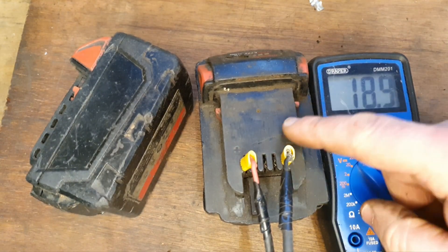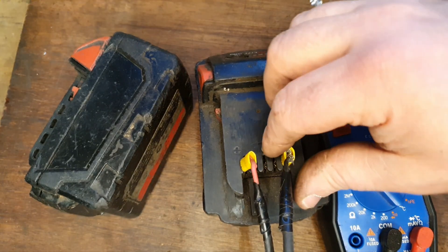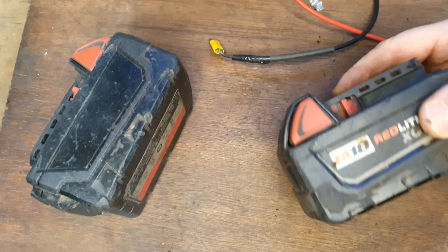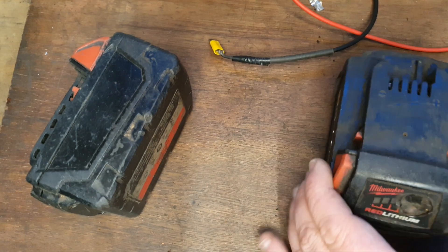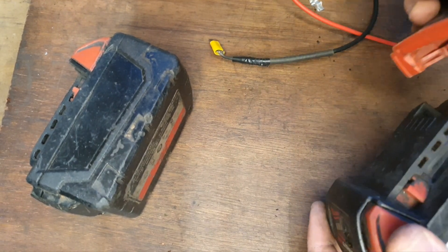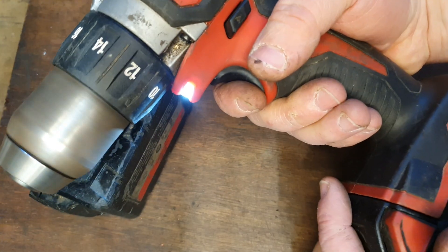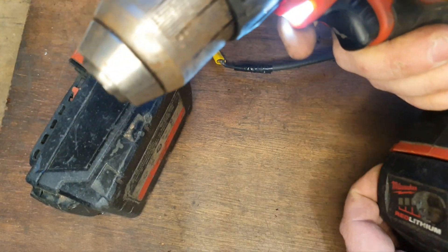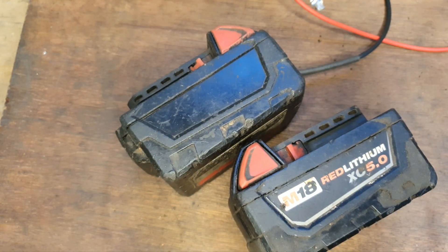Battery number one had been on charging for a while there and it's got up to 18.9 volts — it was still charging. I'm pretty confident it would get up to maximum voltage. When you do the jump start, it's best to leave it overnight and have another look at it, because sometimes it can fail when you heat up the cells like that. I'll try it in the machine and see if it goes. That's those two batteries fixed. If you liked this video, please give it a thumbs up and check out my channel for all my other videos.